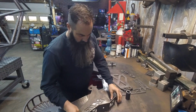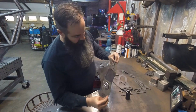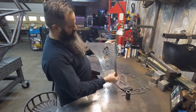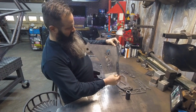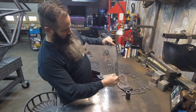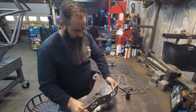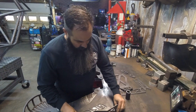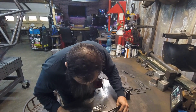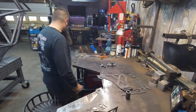And there you go. Once I've got my shape, I just offset it down. You can offset it about any amount you want. Something to watch when I offset it down: it's set up for this edge to match the circle, that way it doesn't interfere with your pipe. So once you've got it there, you may want to give it just a couple of little tacks to hold this part in place.